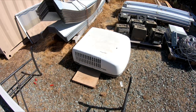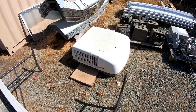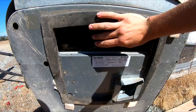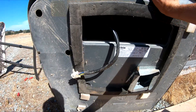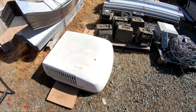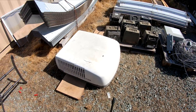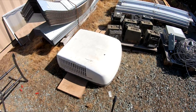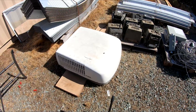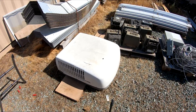Now, this air conditioner is temporary. I'm going to be installing this — a Duotherm by Dometic air conditioner off of an RV. It's right around 14,000 BTUs, so it's pretty big for that room. I just need to cut out a square hole on the bottom. I've already figured out the pinout for this plug — I have a neutral, fan high, fan low, and compressor connection. All I need to do is tie that into my PLC cabinet. I'll have a temperature probe on my analog input module so the PLC can see the temperature of the room. It'll be able to know how much power is available, and if there's excess power, it can use that to run this AC. If we hit a critical temperature, it could fire up the generator if there's not enough power and run this air conditioning unit. A lot of functionality will be added by making the thermostat within the PLC unit — that's another advantage of having a system as flexible as the Click PLC.